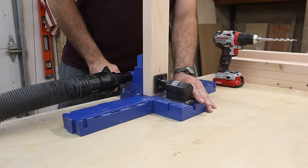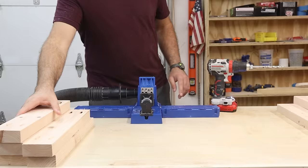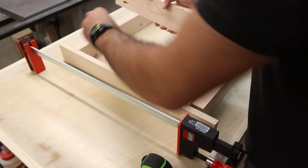Now, this will make sense in a second, but there are 6 total legs on this table. The front leg and the corresponding back leg are connected by some side stretchers. The left front and back leg have 2 side stretchers, one up at the top, and another set 1.5 inches from the bottom. The middle and right, front and back legs are held together by 3 stretchers, one at the top, one at the bottom, and one in the middle, which will eventually hold a shelf.